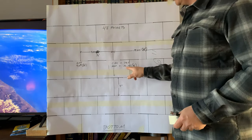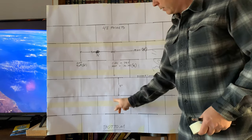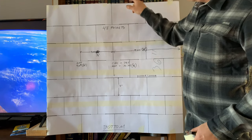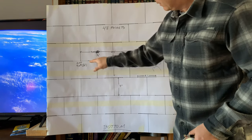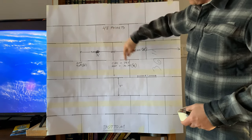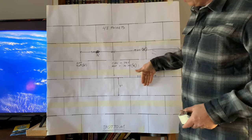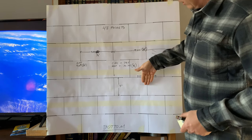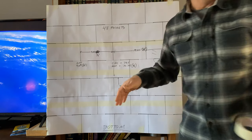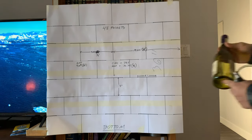From that point I measured the halfway point, which was 36 and 3/4 inches — that's my halfway point — and I created a staggered line. Each pocket distance here is five inches and they're staggered evenly going across. Each pocket itself is five inches across, and that's where you'll be cutting with your jigsaw.